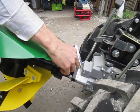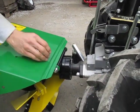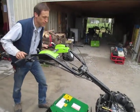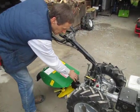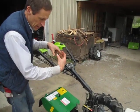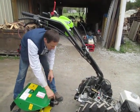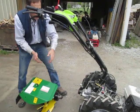However, if I pull this foreign material out of here and come off of there, it's going to go right in. There we go. So make sure the surfaces are clean. Often if you're running an implement — tiller, plow, mower, whatever — dirt will build up around this area because it gets thrown up there by the implement. And when you separate the tractor and the implement, that dirt falls down onto the male portion of the quick coupling. It can fall down on top, and if there's a little pile of dirt there, it gets sandwiched in and now it doesn't go on far enough.